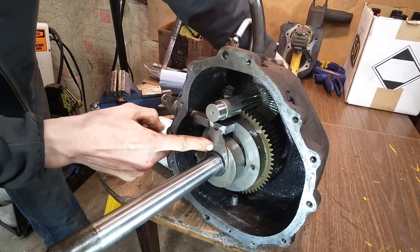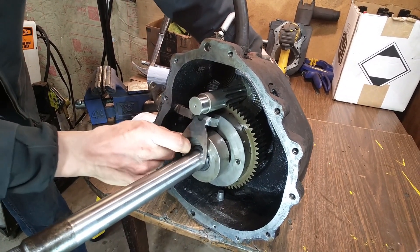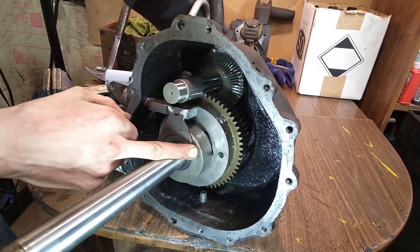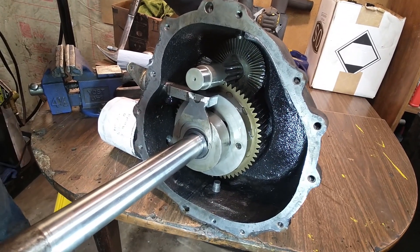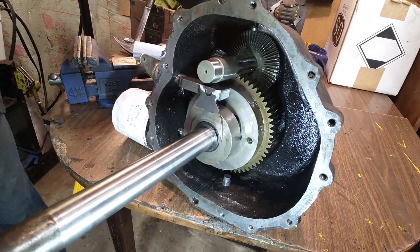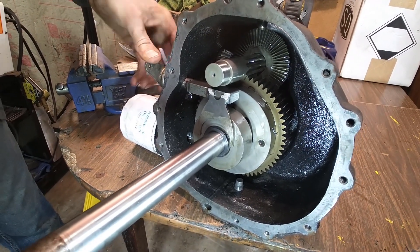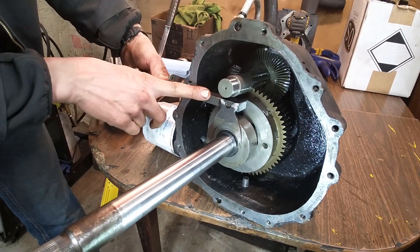This diff lock system on the 3000 series is very, very simple — dirt simple. If you see one of these and own one, you'll understand why they tell you to do what they say: stop movement of the tractor before you engage the diff lock. That's the big thing most people miss. You've got a cable connected to this lever here that goes through the case.